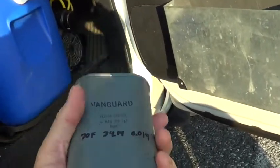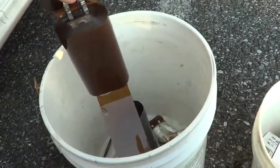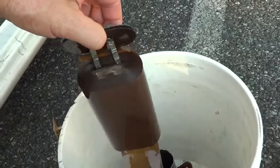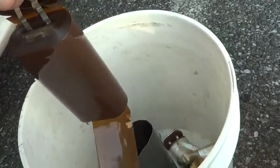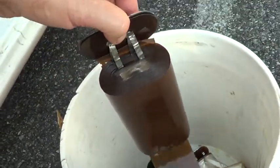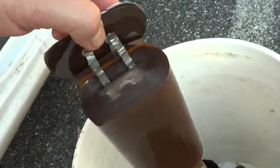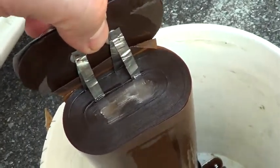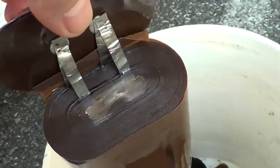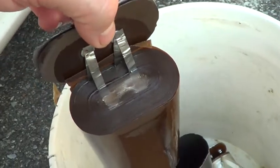Let's look inside this big old one — no wonder these never fail. This thing weighs a good three to five pounds. Look at all that PCB. It's not cardboard, not paper — it's a type of plastic, but it's just massive. The insulation is massively thicker than a modern 35UF. See how thick the aluminum is. It doesn't have the new tin-end technology; it has to run a conductor to the middle and gets one contact point on the roll rather than the entire side like a modern capacitor.